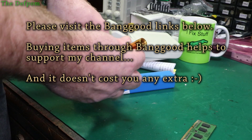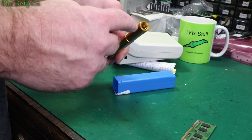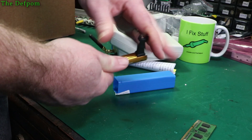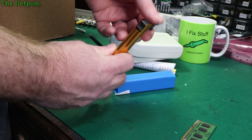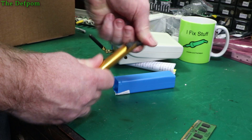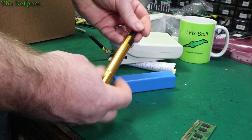And it's got an adjustment in there. I've got no idea what the adjustment range is - it was mentioned in this thing. But there's an Allen key in here; you just do that up to increase the spring tension. It's basically a toggle thing which pops over and will go either way. It's got a detent here - basically a ball bearing inside which pops into the detent. So that force of popping that spring out is what acts as the torque.